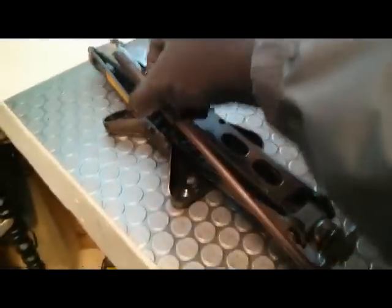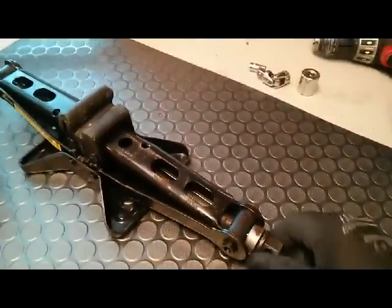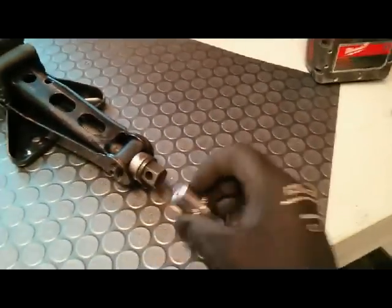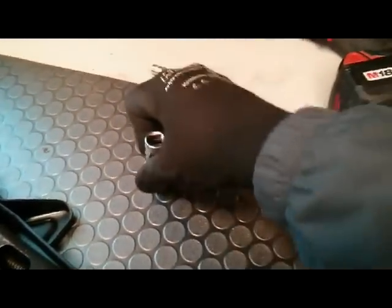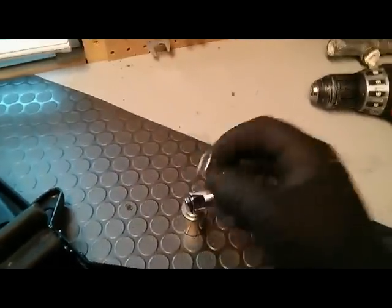Basically what you need to do is get rid of the handle. I used a grinder to just cut it right here, and it ends up looking like this — basically a screw. This one turned out to be three quarters of an inch. You put a socket on it, and what I did is use a little flexible joint so I don't have to keep my drill perfectly aligned, and a little adapter three-eighths of an inch to a quarter of an inch.